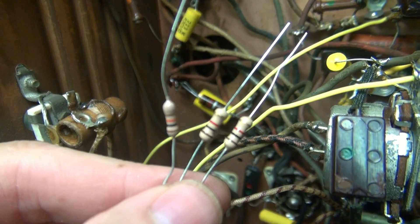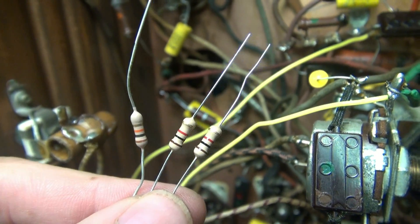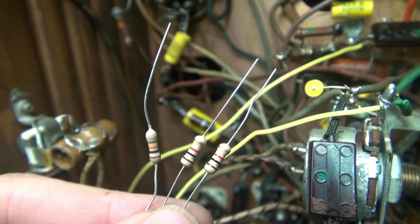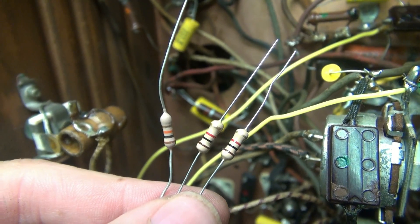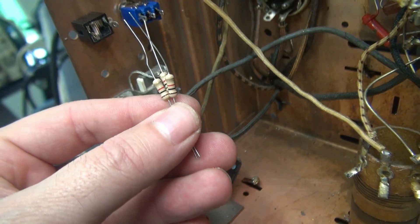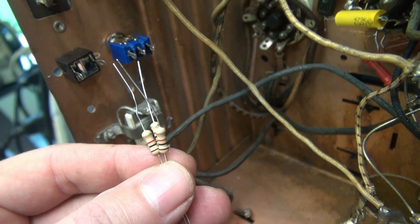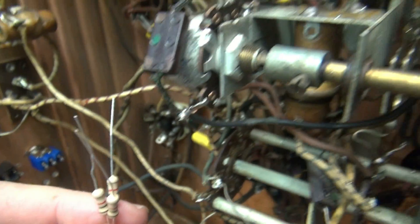Now it's time to install the resistors. We have two 1k resistors and a 10k. The 1ks will be on the signal lines off the stereo jack to the switch. The 10k will go from those lines to ground to provide a load that the MP3 player will be happy with. We're going to go from the two centers to one side of the switch, and the ground to that side of the switch, which represents the load that headphones would give an MP3 player.